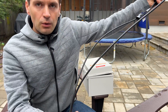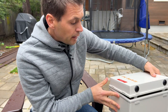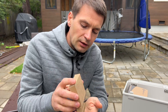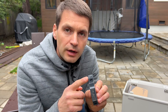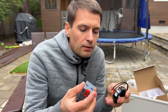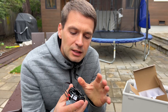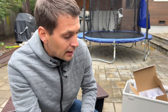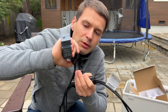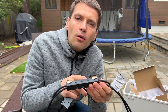The longer side is connected — we connect some panels in series or in parallel depending on our configuration. Then in a garage or any place, we install this enclosure. What we have to install here: first is a power adapter converting 120 volts AC to 12 volts DC. This 12 volts DC powers this transmitter, and the core is connected to the transmitter. The positive wire from the solar array passes through this core and receives signal. So when the transmitter is sending signal, the device is going to pass energy from the solar panel to the output. If we cut the power to this transmitter, it will stop sending signal, the core will stop sending signal to the AP Smart devices, and this is going to cut power under each panel.